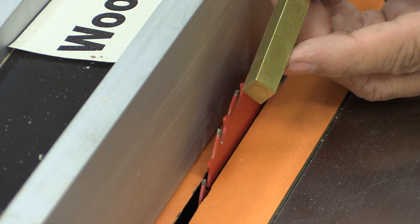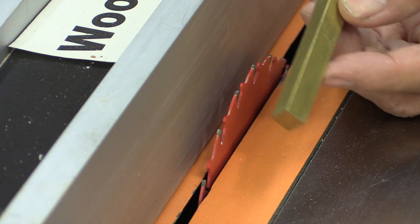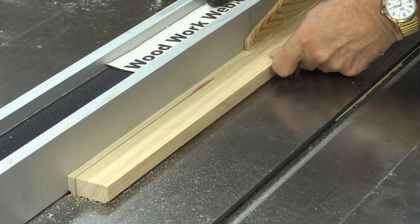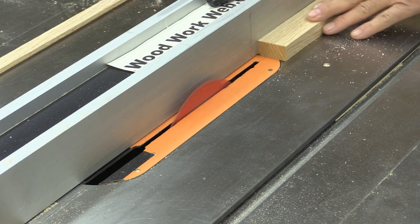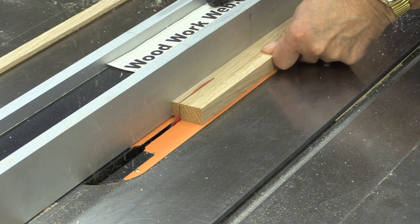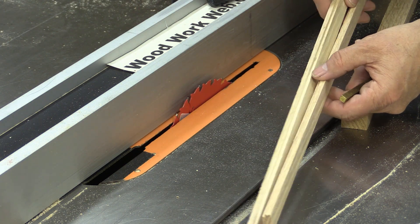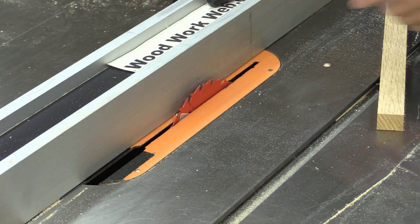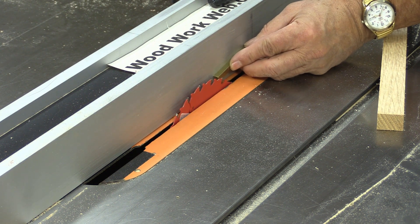This jig is going to consist of two rails joined in the middle and on the ends, and I'm going to use bolts for that as well. It's much easier to cut the rabbets when the wood is whole and then cut the strips off after. I've put a thin circular saw blade in here because I need to cut a very fine rabbet. The depth of the rabbets I'm cutting are a little bit more than an eighth of an inch, and I'm using a drill bit as a measuring block — that'll work just fine to give me a very accurate cut.